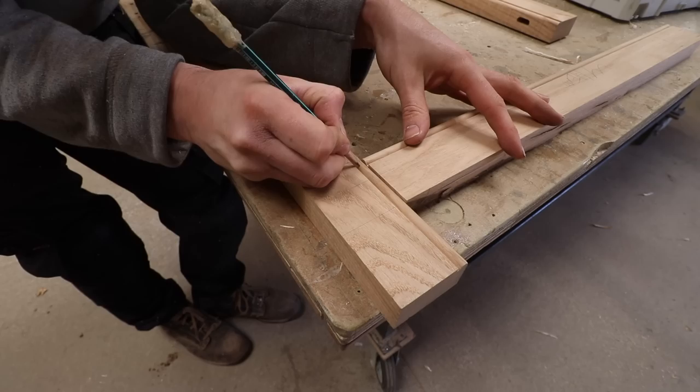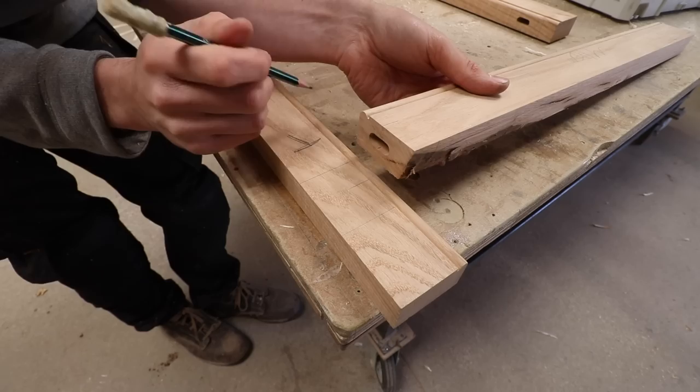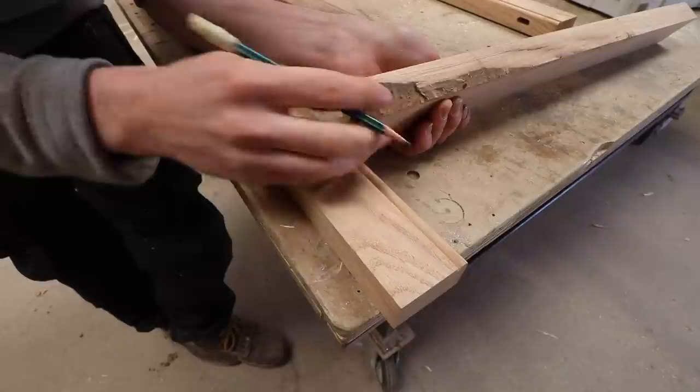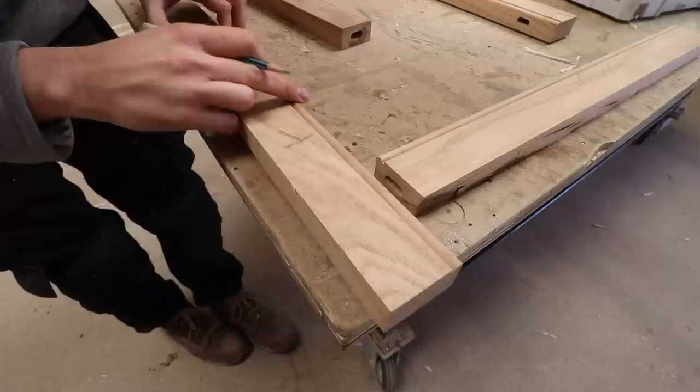Now if this was a shouldered tenon, so if there's a tenon sticking out here, you'd just be mitring this shouldered part and not the rest of it, so the rest of it would be a different shouldered tenon. So probably not worth talking into, it's just going to confuse the matter, but one shoulder would be set back from the other because one shoulder would meet this point here on this edge, and then the shoulder on the back would be meeting this uncut edge, so you'd have sort of a rebate on them shoulders.